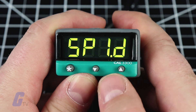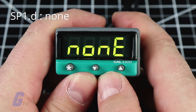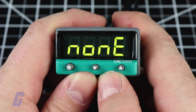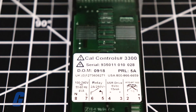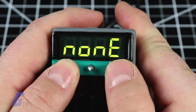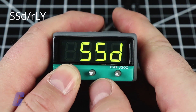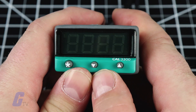Press the up arrow once and the display will now read 'SP1 D none'. You will now select SP1, the main setpoint output device. Note that if you are using models featuring dual relay or dual SSD output options, their outputs are pre-configured, so proceed to the next step. Otherwise, press and hold the asterisk button and use the up and down buttons to select SSD or relay as required.